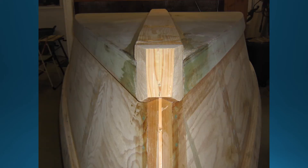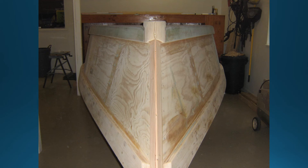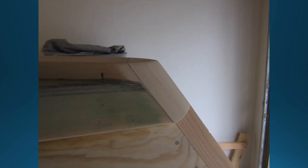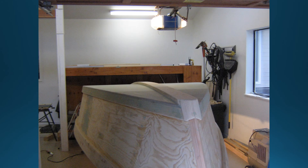Now that you have cut all the overhanging stuff off, now what? Pick your favorite tool — I used several: a block plane, an angle grinder, and a sander. Unleash your inner creativity and remove everything that is not a boat. This is what I came up with — sort of looks symmetrical, at least. The only thing I did to the cutwater at the other end was cut it off parallel to the shear line. I filled the gaps and screw holes with my new favorite green epoxy fairing compound, and the next day I sanded it out.